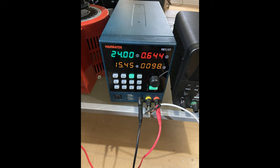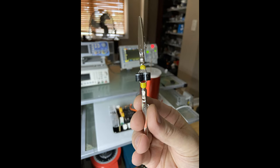Let's go ahead and move on to the power source. Now, the ZVS Tesla coil is going to be a little different. You need to start up the Tesla coil at very low power. 12 volts works perfect for this. You can set it up in oscillation first, and then you can add power to it afterwards. However, you do not want to start off with a lot of power right away. For this reason, if you could put in some diodes, then you can have two different power sources. The reason the diodes are there is because any energy that goes in from one power source will feed back to the secondary power source. So diodes on both will be perfect for this in order to have two different power supplies.